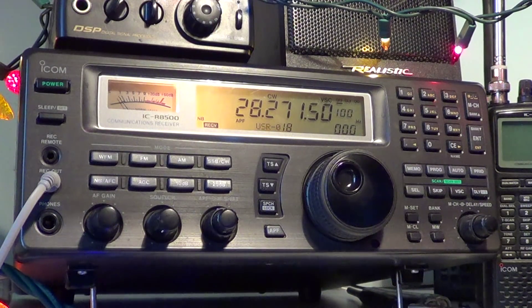Welcome to this radio video. I'm going to talk a little bit about 10-meter amateur radio beacons. These are made to help with propagation — so when you're on the 10-meter band and you want to know if it's open, maybe you don't hear anyone and think the band is dead, you can go to the beacons section. If you hear beacons, it means the 10-meter band is open. The beacons all ID their call signs in Morse code. If you look in the description below the video, I'll put a link to one of the lists I like that is updated regularly — it's a list of amateur radio beacons on the 10-meter band.